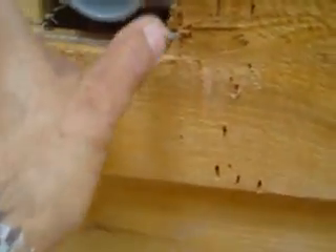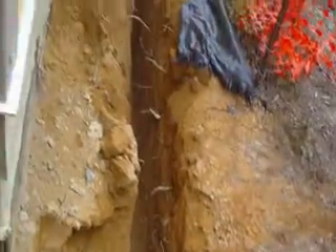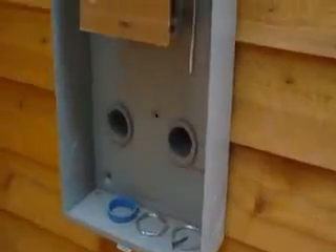I just got them sitting in because the inside still has the cardboard on it, like we do on the rough end, and all the wires are in it. Someone's just going to try to slide this up to it. Right now I'm just putting it up because the power company wants it — they're getting ready to run their wires and they won't hook to it unless the meter base is up. We've got our level, and now we're going to put some 100% silicone caulking behind it.